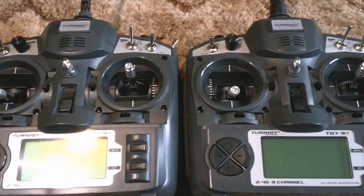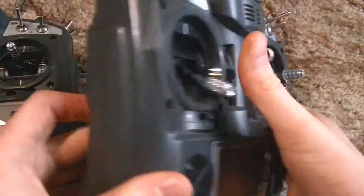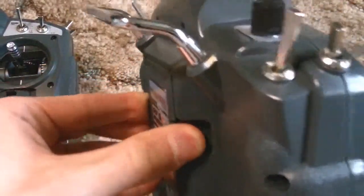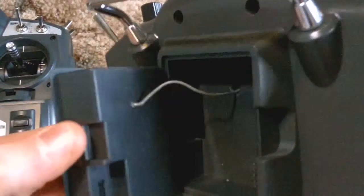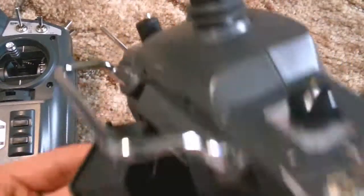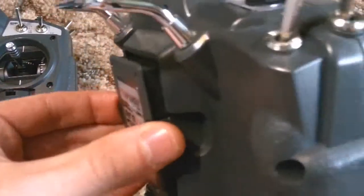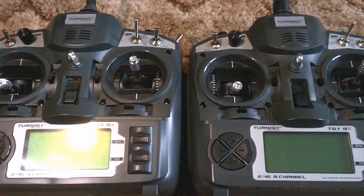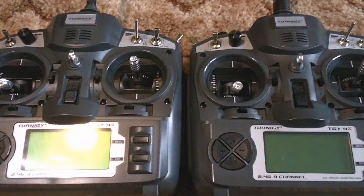The main motivation for making this video was that many months ago, Bruce at rcmodelreviews.com did a review of the 9XV2. Here's a stock one. He showed that unfortunately, unlike the V1, the actual transmission module is hardwired into the radio body, because the antenna is now on the body instead of on the module. So obviously that creates a problem where if you want to use another module, you have to cut the cable, and in doing so you won't be able to use the original system anymore.